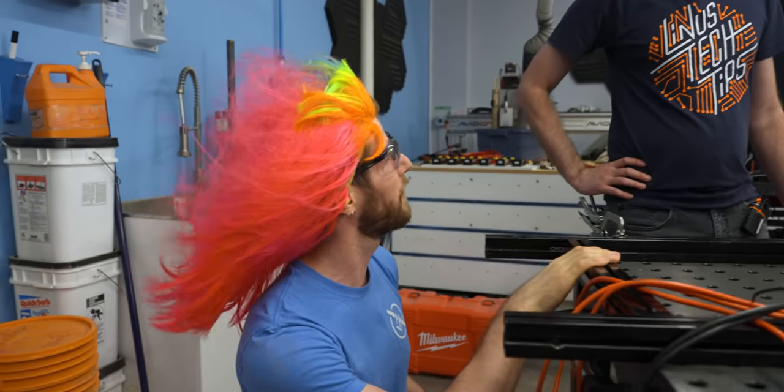Okay. GPU stress test. CPU temps are immediately 100. We need to do something here. Okay, so we're still at 100 degrees though. 98. Our main issue then is basically just that we don't really have fans directly on our heatsink.